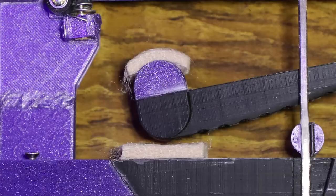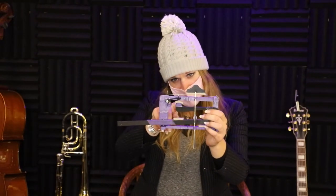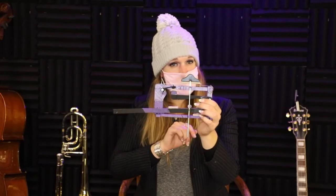It worked fine for a demonstration, but I went back and iterated on that anyway. So instead of having a diagonal cut between the head and the arm of the hammer, I moved the slice from mid-arm to at the top of the hammer. This allows an added benefit of also being able to fill the hammer with lead by making it hollow. I didn't do that for this demonstration, but when we actually make a production or playable design, that is something I'll definitely do. You can see on the model here — I printed the hammer arm piece and the hammer head in different plastics, so you can see the line where the two are conjoined.